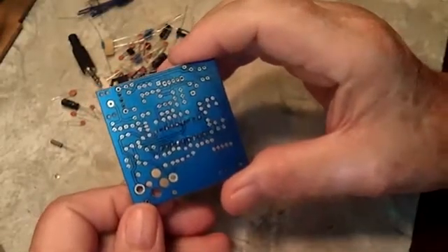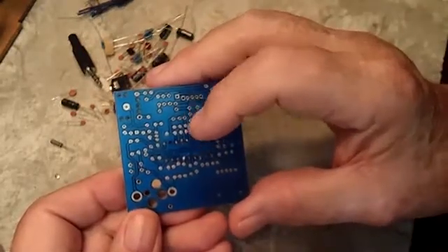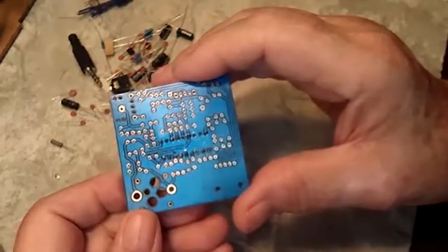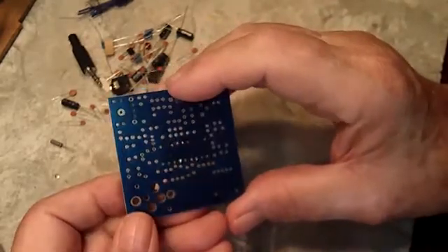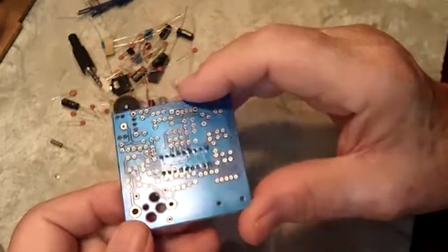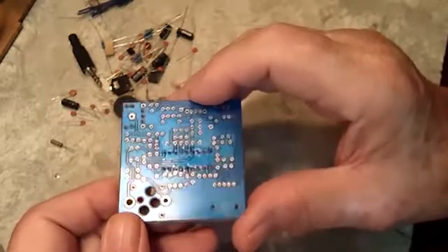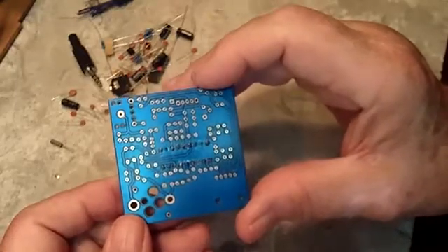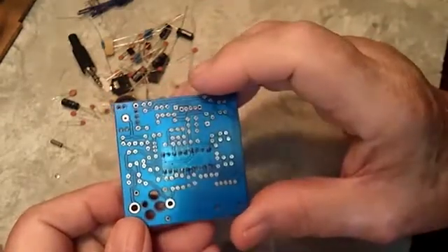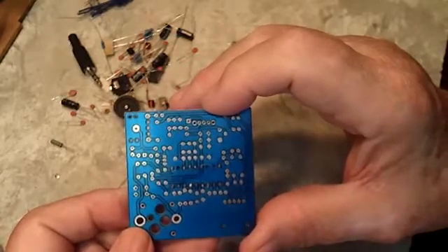I ran into my first problem. I went ahead and installed that socket as I said I was going to, but this thing took forever to solder - those pads are not very solder-friendly. What I did was use some steel wool on the rest of the board to rough up the pads so the solder will take better. Hopefully the connections are alright. Just a reminder - if you bought one of these kits, take some fine sandpaper or steel wool and run over the top of the solder pads to rough them up a little. It should help.